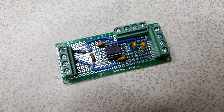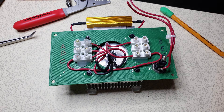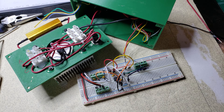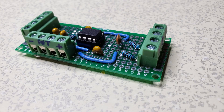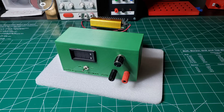Although I originally thought to use a PCB for this circuit, I just ended up putting all the small components on a little perf board. I started with the assembly of the back panel where the heat sink is mounted. The MOSFET sits directly on the heat sink like in the previous version. This time, however, I used screw terminal blocks to connect together the high current components — the MOSFET, the 1-ohm resistor, and the fuse. I also attached the diodes directly on these connectors so they are close to the MOSFET leads. Notice the power resistor sitting on top of the heat sink. Before assembling the final circuit, I ran some tests on a breadboard, and once I was satisfied with the results, I started making the final circuit on the perf board, adding screw terminal blocks to facilitate connections with components that could not be assembled on the board itself.